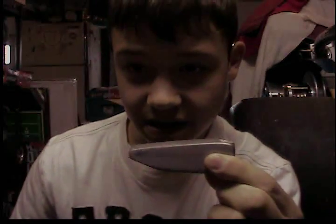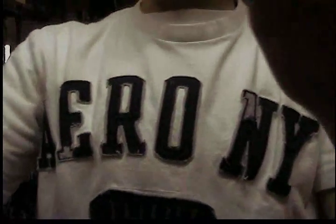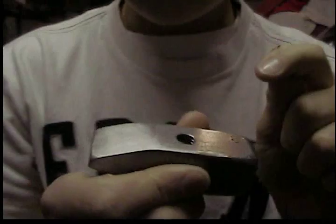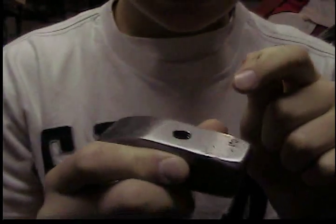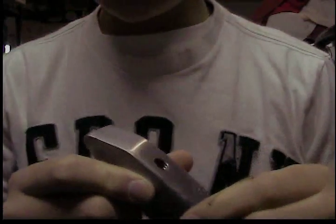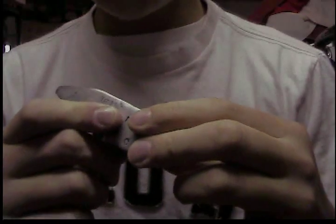Mine is kind of messed up. I have one of my brother's hammers to show you — he made two of them, one in his sophomore year and one in his senior year. That's how the hammerhead is supposed to look. We also used a five-sixteenths inch drill bit and drilled in five-eighths of an inch, then used a three-eighths inch coarse thread tap to make the threads.